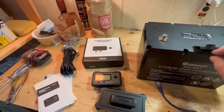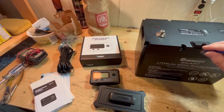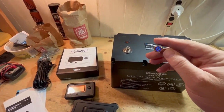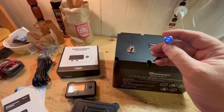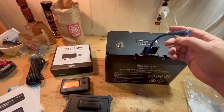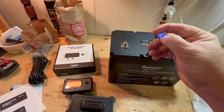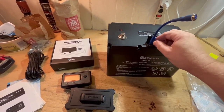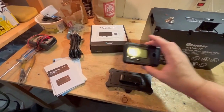To activate your battery, there's the 'up' button and the 'link' button — the up goes to the control and the link connects one battery to another. You can have multiple batteries together. If you notice it's a slightly light blue color, that means the battery is dormant. Hold it for about three seconds and it becomes bright — the posts are now active and the battery is awake. To put it back in storage mode, hold it for a couple seconds and the light goes to a dim blue, meaning no power to the leads, which is good for storage.